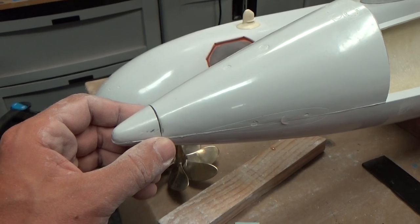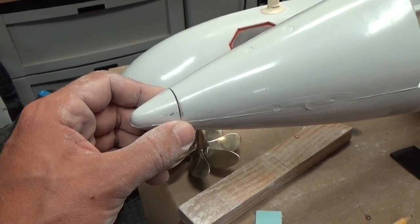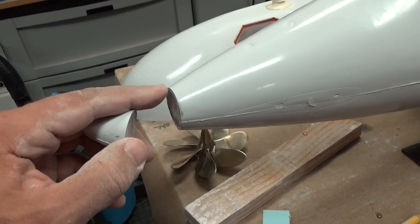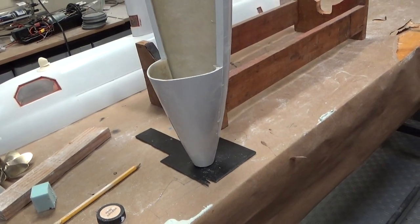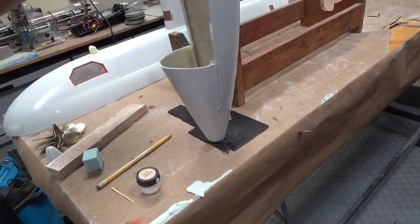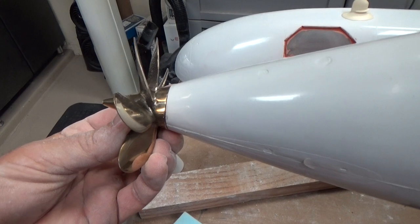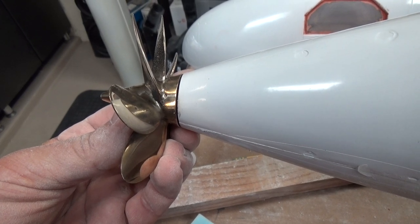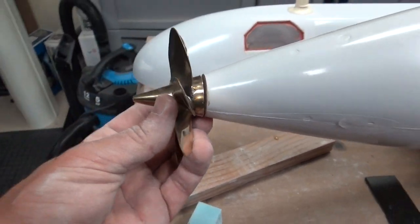As I mentioned, we did a little bit of cutting on the tail there. I marked out the length that I needed to cut off of that tail section and did so just with a hacksaw — a nice straight cut after marking out the perimeter with a pencil. In order to do that, I stood up the model on a table, spun it around, and marked out at the appropriate height to get a uniform circumference around the perimeter of the hull. As you can see the resultant mate-up there is just about bang on. It will sit about a sixteenth of an inch out because we are going to put a little spacer in there, but that is what it's going to look like — just gorgeous.